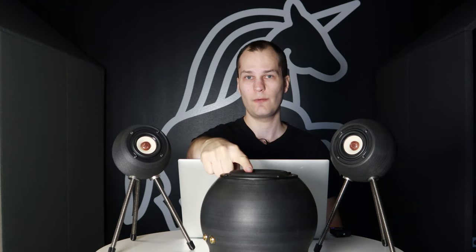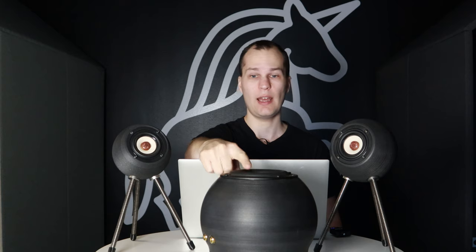Compared to our previous version of the 2.1 sub and satellite system we have reduced the footprint, because the subwoofer in particular was quite large and took up a lot of space on the desktop. Now we are using three-inch drivers instead of four-inch ones, with a smaller diameter enclosure, and a 5-inch subwoofer driver instead of the 6.5-inch one used previously. The enclosure is much smaller — about 5 liters instead of the 13 liters of the previous build.